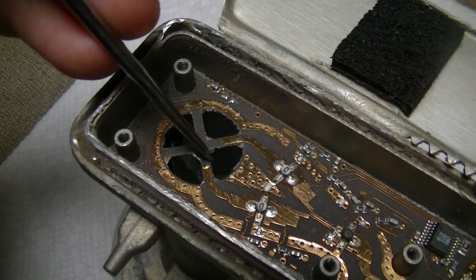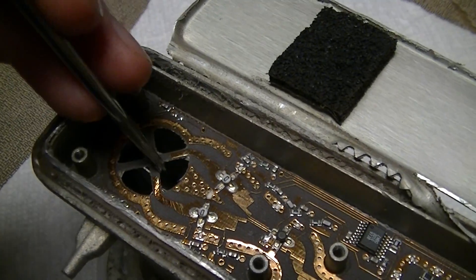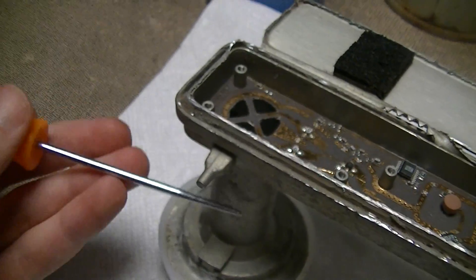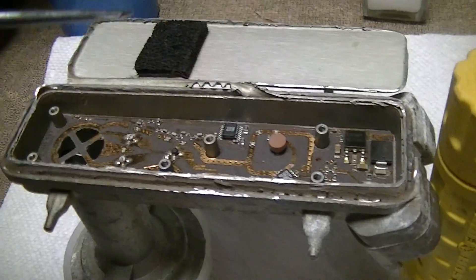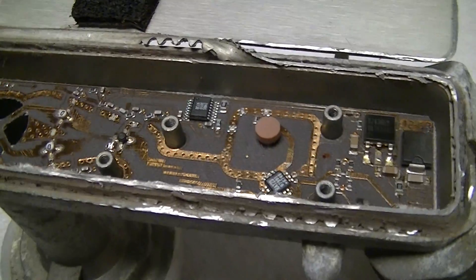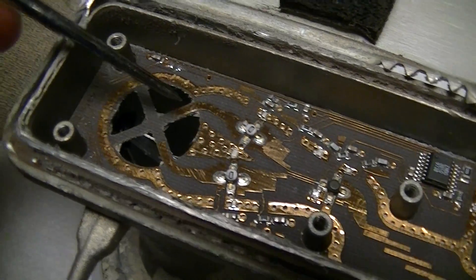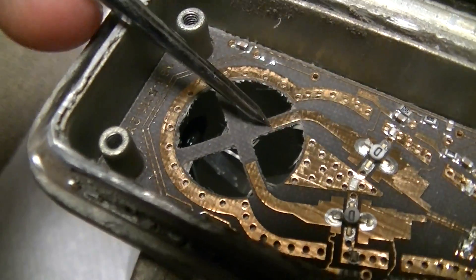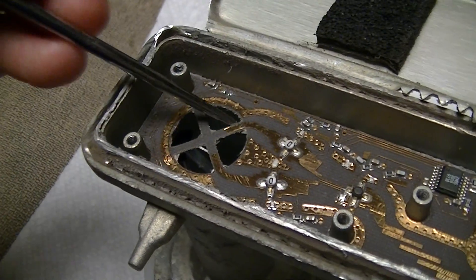There's this little assembly that has the two antennas on it. There's also some kind of a little plastic wedge glued into the interior of the feed horn, as well as a solder cap, which is just to keep dust and crap out, because the RF Blackmagic material doesn't like environmental contamination as it throws off the RF properties. The two antennas are offset at 90 degree angles to each other, and one has a notch and appears overall slightly longer, so those are probably for two slightly different frequencies.